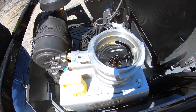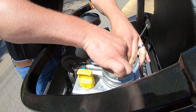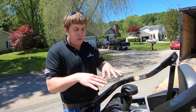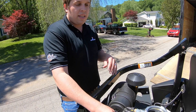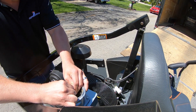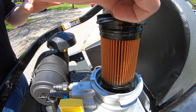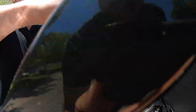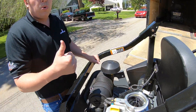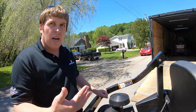That's 500 hours for break-in, then 500 hours after break-in for the oil change intervals. You twist this cap — it's on pretty tight — and it takes the oil through the engine, up through one of these lines through the top of the filter, then down through the filter slowly. This filter right here filters it a lot better. Do you see how big this filter is? It takes around two minutes to cycle the oil through the engine and then down this aluminum oil cooler. You're burning cooler, cleaner oil, so you can go 500 hours between engine oil changes rather than 100 hours, which is the standard.